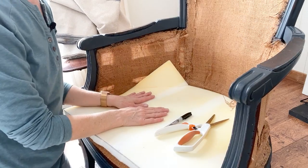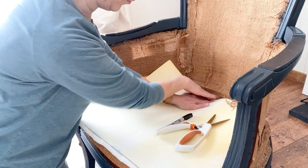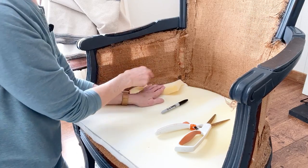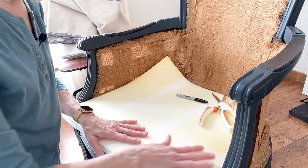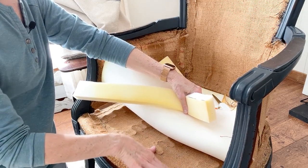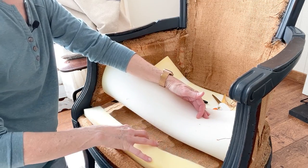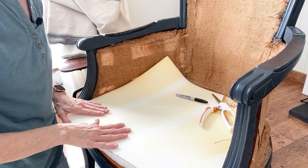It's time to cut off the extra. I'll lay the piece of foam down, lined up in the front and on either side. I fold the foam and use my marker to mark little dash lines around that curve so I know where to cut. Now remember when we took the front part of the deck off I had to cut a seam that held extra batting and stuffing — that's because on my chair this part sits a little lower. To compensate, I'll lay that excess piece of foam in there so it goes over top and allows that extra cushion that was originally there.